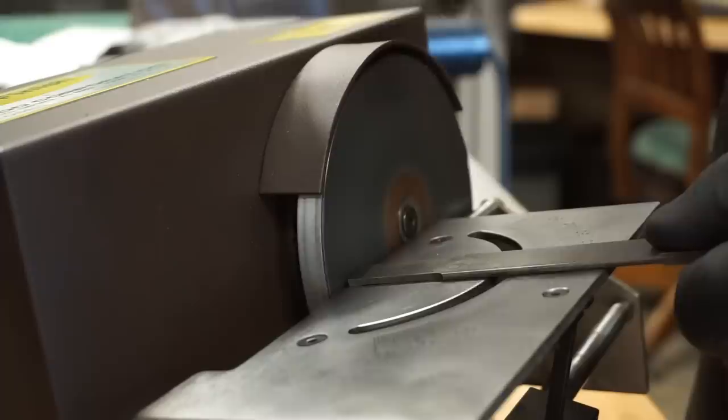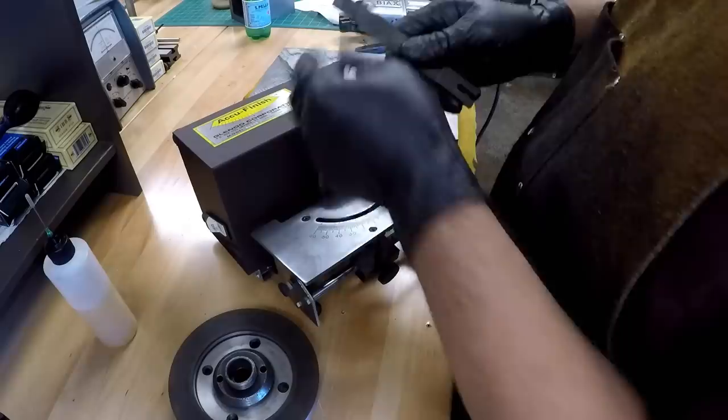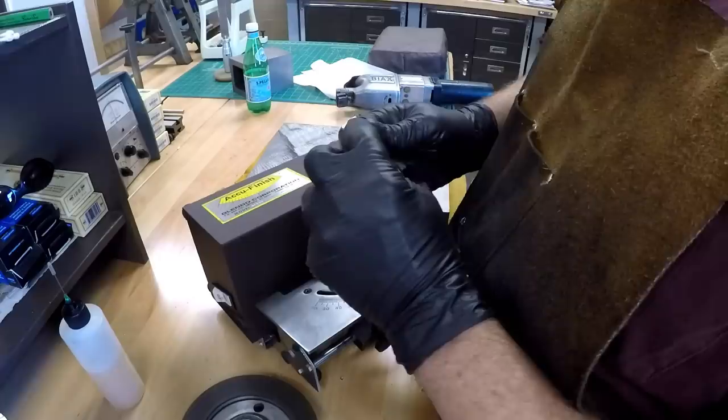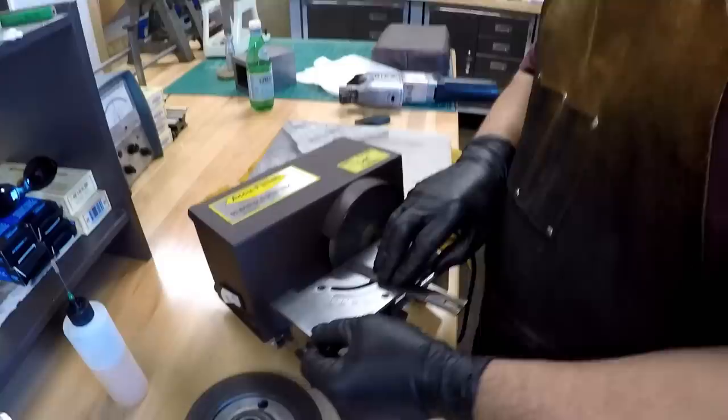The reason for that is if you were to flip this around, change this angle 5 degrees this way, and you are grinding the bottom edge, carbide's fragile. And listen, I'm not going to explain the science. I'm not qualified. But my understanding is if we were to grind off this bottom edge, you're probably going to be chipping it out. Exactly, because it's real brittle. And my understanding is you get a lot of micro fractures along that edge, and it will not be sharp, and it will affect your cuts. So that's why this table looks like it's tilted up.